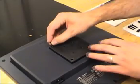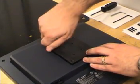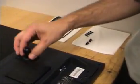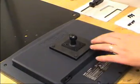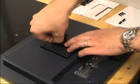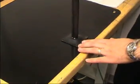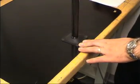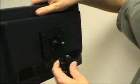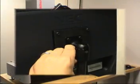Mount the provided mounting plate to the back of the monitor with four M4 by 20 mm cap screws and 4 M4 washers. Mount the pedestal mount to the mounting plate with the 4 M4 by 12 mm cap screws. Mount the pedestal base to the monitor stand base plate with 4 M4 by 4 mm cap screws. Attach monitor to pedestal base, align, and securely tighten clamp.